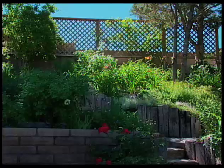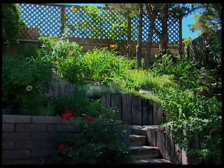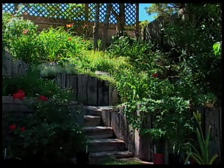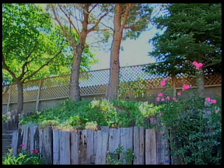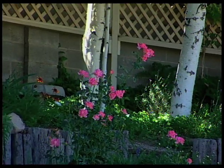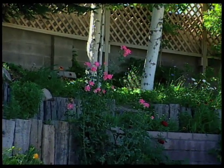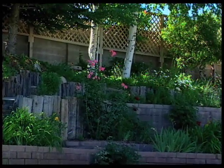This was an 18-foot gradual slope when they moved in. The line of the slope just traveled down the side of the property, so the only solution was to bring the wall further in, closer to the house. That allowed Alan to move the dirt forward. He first built the wall with nothing behind it, so there was no load bearing on the wall itself — it was essentially built at the bottom of the slope first, then the soil was brought up to it.